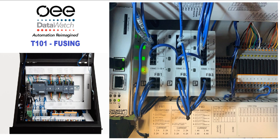Here is a very important reminder. The factory default is 2 amps per channel for fuse block 1 and 2, 2 amps per channel over here, you can see on the label, and then 4 amps per channel on fuse block 3. They're the outputs over here, relay outputs. There's a total of 16 amps available right there, and 16 amps there.